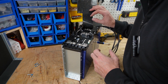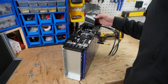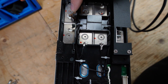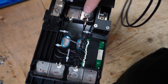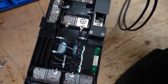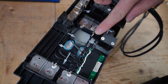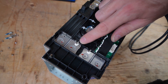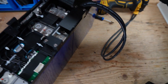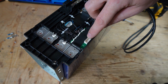We have a thermal probe over here. They actually have a potted terminal for the thermal reading of the battery — one here and another one directly on the battery bus bar itself, not just fixed to the cells. Two potted thermal terminals on top. All the balance leads have their own little compartment with a small squirt of glue to make sure they don't back out, and they all run into a small board that connects over to the BMS.